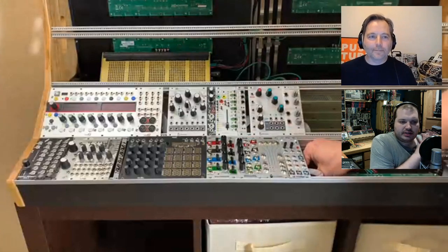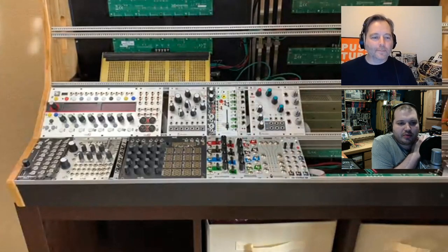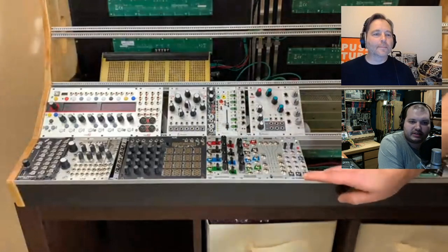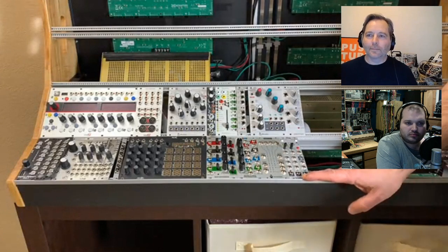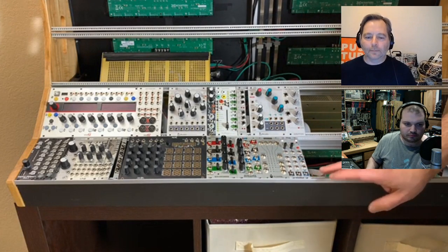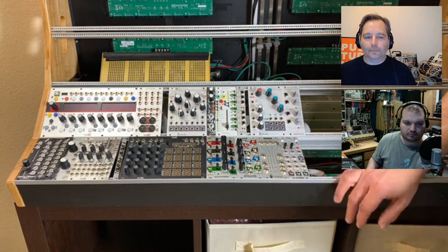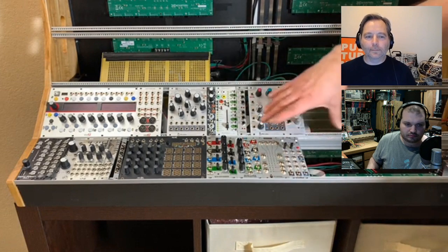Well, we're talking about the initial kind of start of the case. I think Mark has clarified in the chat what he meant with the voltage standards. He's saying, could you communicate with Buchla or Korg in this system? Buchla is 1.2 volts per octave instead of a volt per octave, for example. Yes, I can. For example, those functions are built into distings, and I will have distings in this case. Okay. So they do have a linear log converter, and they do have the Buchla converter as well. And I can't remember, but I think that might have been an option on the FH2 to do the Buchla scale as well. So yes, I can do that translation. The other equipment that I have right now, the vintage gear, is 1 volt per octave as opposed to linear. Although that said, I still have a Korg MS02 lin to log converter.